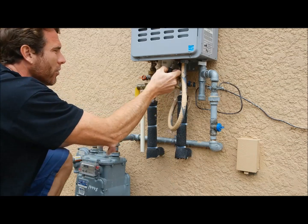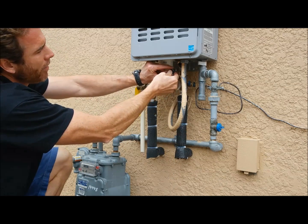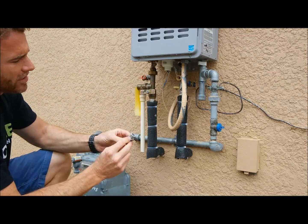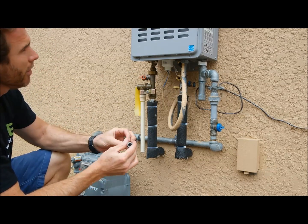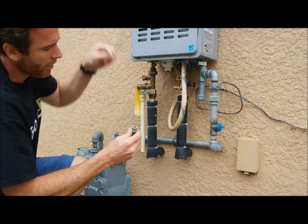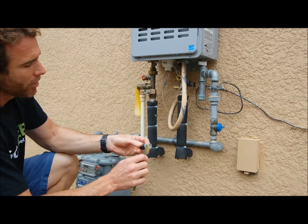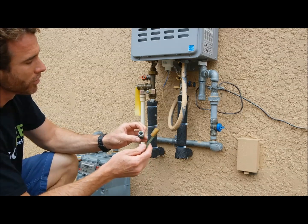Oh, it's going to work its way out. There's a little retaining strap. You can pop it out of there and look for any sediment or debris that's caught up in there. If you need to, take an old toothbrush and clean it off underneath the running water. Scrape anything free. Old toothbrush works great.